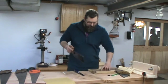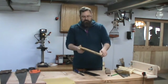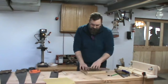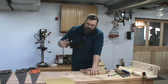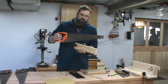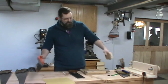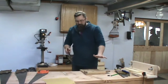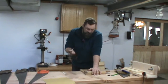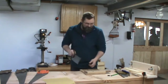If you want to cut across, you can use a device like a bench hook — just a piece of wood and a piece of plywood held in place with your hand. These saw teeth are pointed forward so they cut when you push. In a Japanese style, the teeth are backwards and cut on the pull stroke — either one works. But if you're using a bench hook, you'll be pushing forward to hold it in place. I've tried using a bench hook with a Japanese saw and it just leads to pinched fingers.